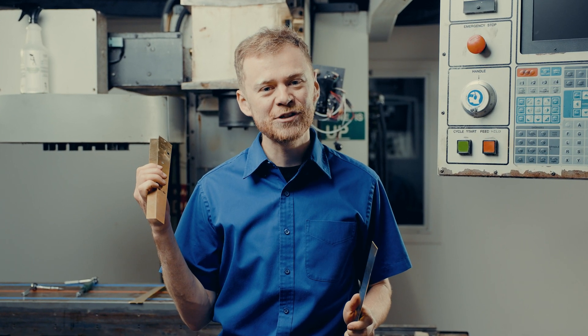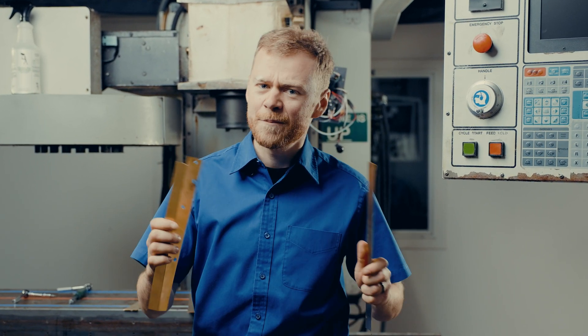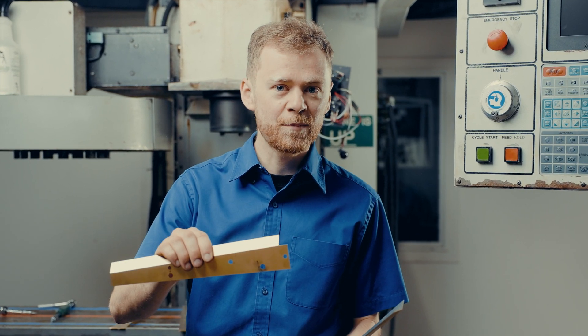I don't have any sheet metal on my machine and I'll act like I do, but you're just going to reach through the window from either side, pull the sheet metal off, squish in the new wiper and bolt it down, and then jog it back and forth. It's pretty easy, let me show you how.